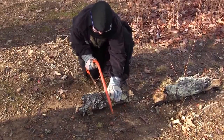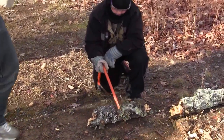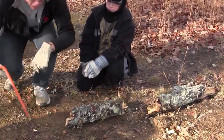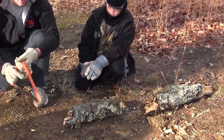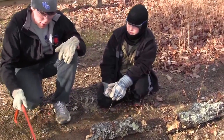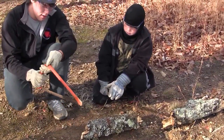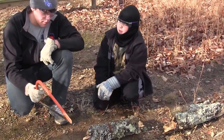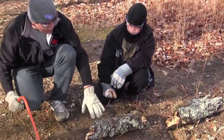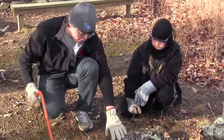Scoot down on the handle a little bit, Jesse. Here's the deal — when using a saw, you don't want to be pushing into the wood because the friction will hold it still. You just want to be moving it back and forth so these little blades can make the incision. If you're holding it up here, it's going to be hard moving back and forth without pressing down on it. It's a good idea to hold it all the way down here at the handle. If it's getting hard to go back and forth, start over doing that groove-making thing I showed you before. Once you've got that pretty good, then you can start going back and forth.